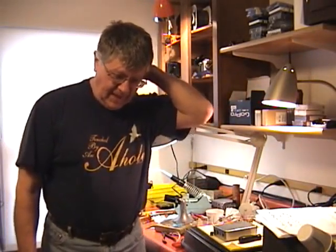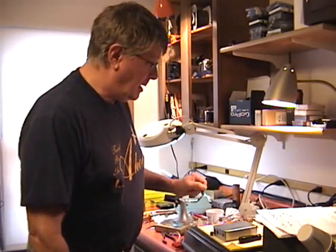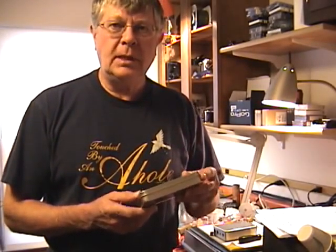In 2009, after reading the article, I contacted Bob via email and purchased one of his kits. The kit came in two sizes: the Altoid size with a single-turn tuning pot, which required a smaller span to be useful, or the larger size kit which came in this enclosure. He included a 10-turn potentiometer to give a wider, better band spread if you wanted to use the hundred kilohertz spread.